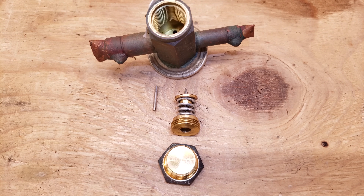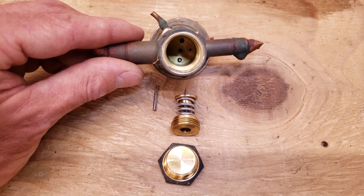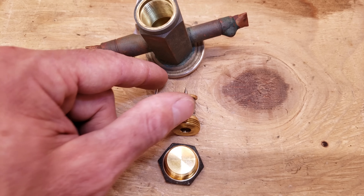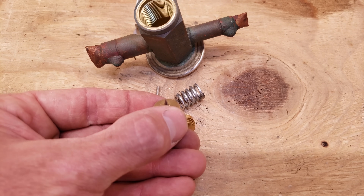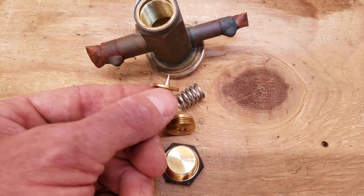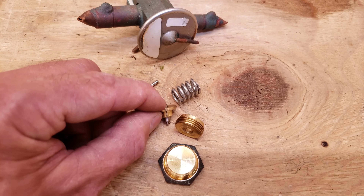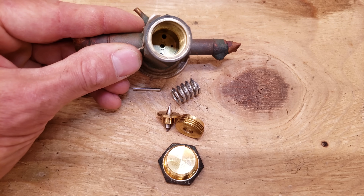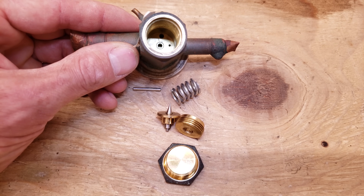Here's a TXV with a two-rod setup — one rod came out of the hole at the top and another is still in the hole at the bottom. These rods push up and down on the face of the valve. The cone-shaped pin closes off the hole unless the diaphragm exerts enough pressure downward to push the needle down for refrigerant to flow through. High pressure liquid enters in the center and exits as low pressure liquid.